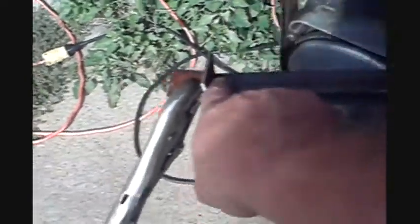This gauge is for quick measurement of the plate steel when I slide it in. This is the measurement I need to make the center plate. How I measured it was with this carpenter's square — I took the measurement off the blade. If you notice, the blade is right up against the flat part and the end of the ruler is at the stop.